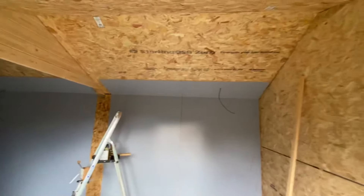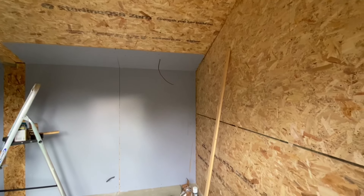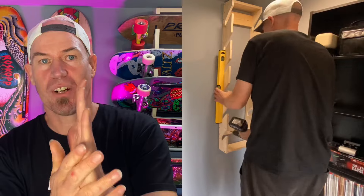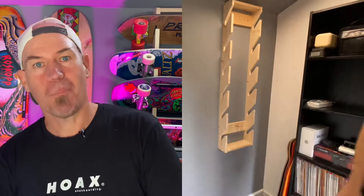When building the new back garden shed, anywhere where there's plasterboard, I mounted OSB board on the back — that meant I could just drill in screws without any wall plugs or dreaded plasterboard fixings. I used a spirit level just to make sure it was straight. Job's done — pop the boards in!